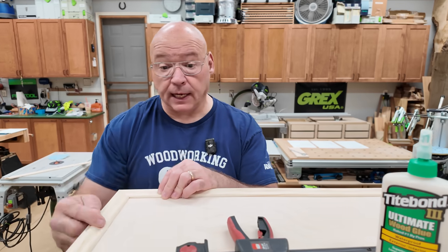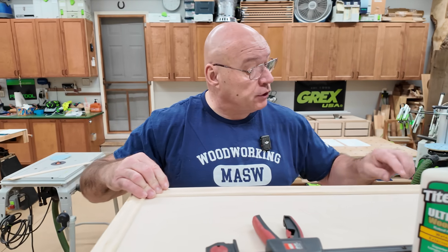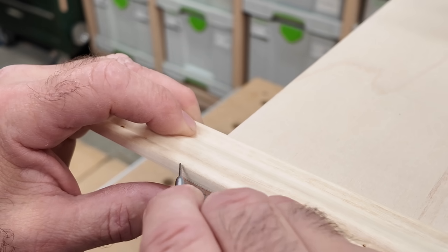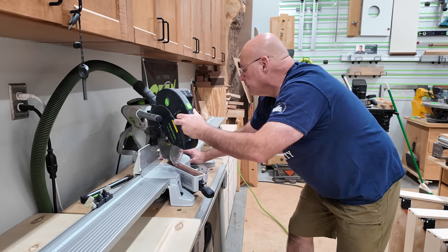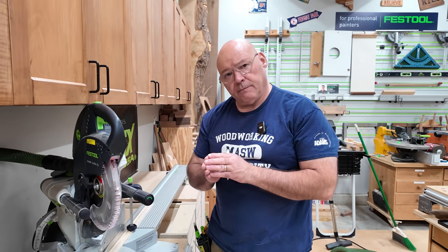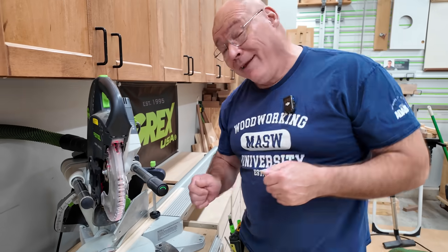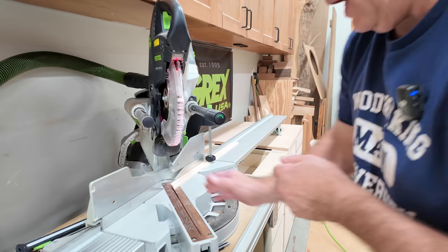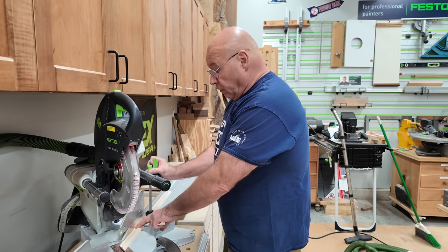We get this side — I just turned the cabinet — we mitered another piece of molding to fit in there, and now we're going to make our mark and go around to do our cover-up. One thing I want to definitely point out on any miter saw: always use a hold-down, especially when you're doing crisp miters like this that really count. The physics of the saw wants to push that piece, and your long or short points won't ever meet up — there'll always be a gap. With the hold-down, you're insured and you've taken yourself out of the mix.